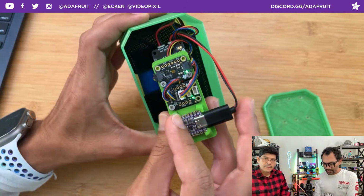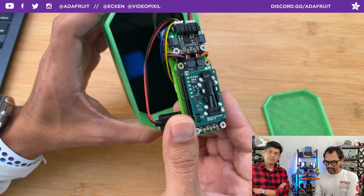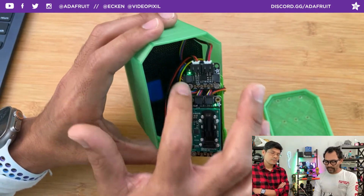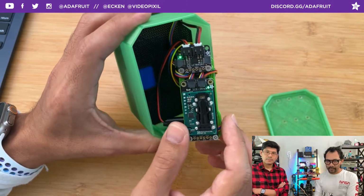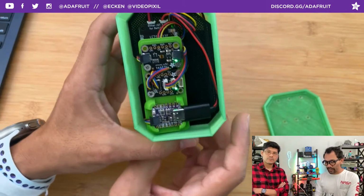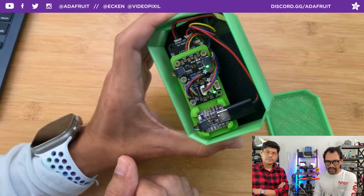Yeah. And it made a nice little nest of these using the new Stemma passive hub, so we can connect a lot more. It's mostly because the Stemma soil sensor doesn't have another Stemma connector. A lot of the breakout boards that have Stemma have 2 ports. You can connect one in and then continue to daisy chain them. The soil sensor one does not, so we have to use the hub on here. And I'm using quite a bit of sensors on here, so I'd run out of ports quickly. So we have 2 additional ones here, so I could stick like 2 more breakouts in there.